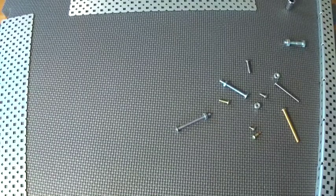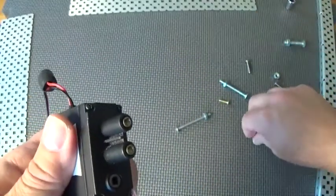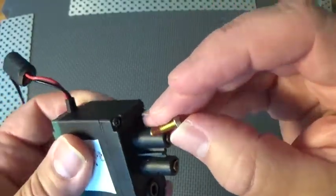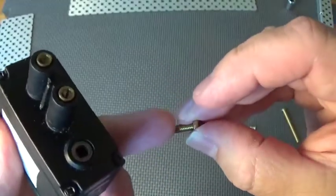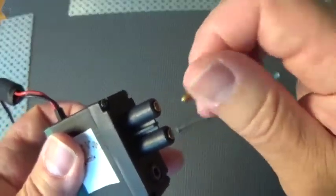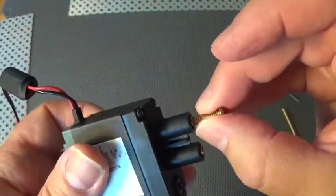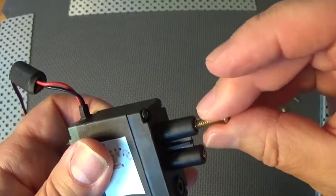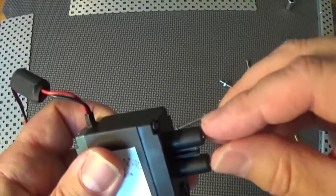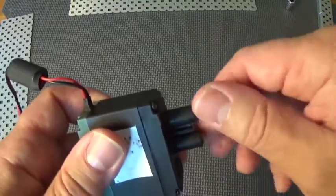That's especially true if you're trying to put a screw into a motor. Because these 6-32 motor screws have epoxy on them, sometimes there's a little bit of resistance — almost like a glue to help hold these things in there. Some kids just keep grinding until the thing is jammed in at a wrong angle. So even with these, before you start screwing the screw into the motor, you just want to back it off just a little bit. Sometimes you can almost feel the click when the threads actually fall into place, and then it should be fairly easy to get it started.